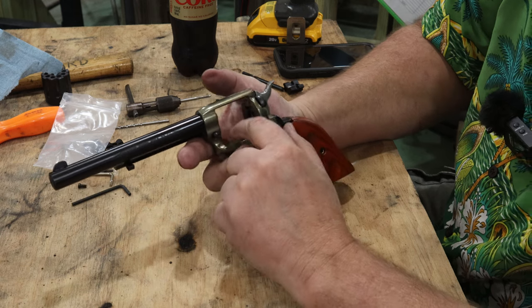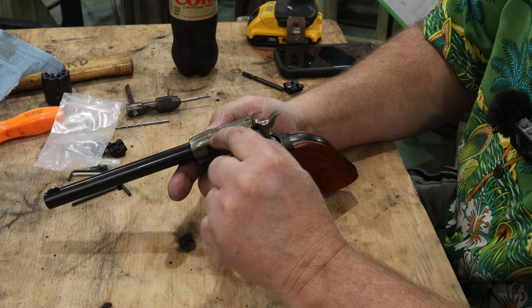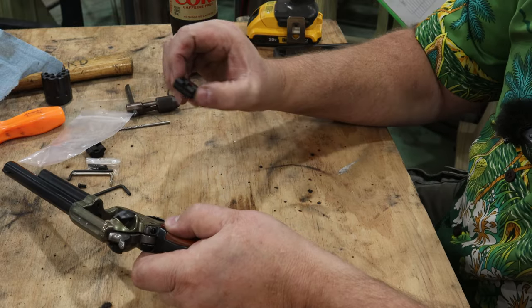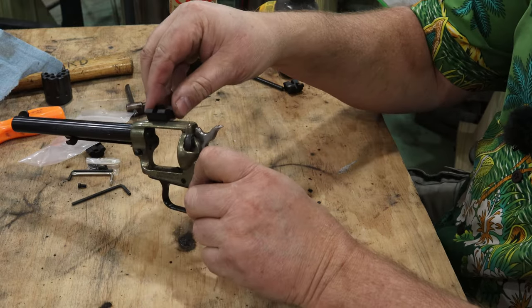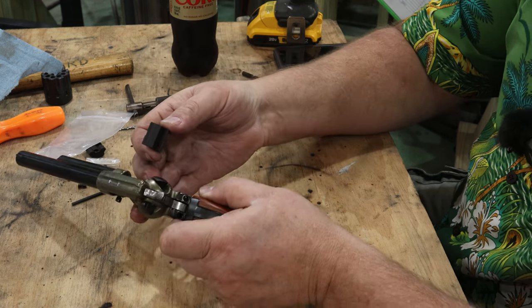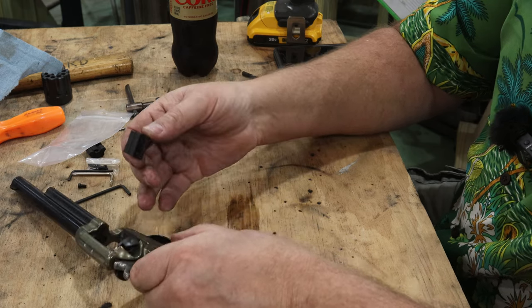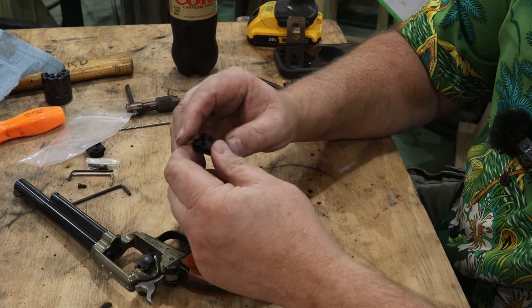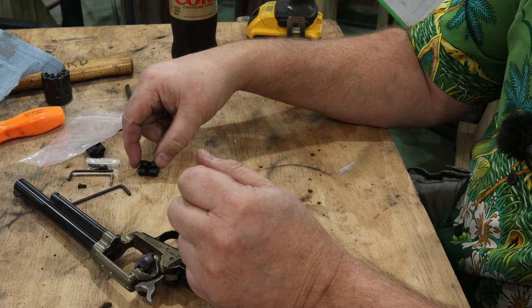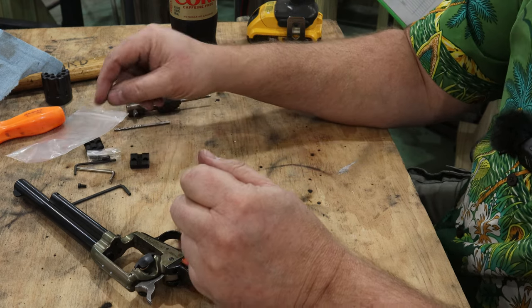So anyway, we're going to go ahead and put a little brake clean degreaser on here. And then I got to do my other little modification to this piece. And then we'll be bolting her right on top and hooking her up semi-permanently with some blue Loctite. My goodness, don't use red or don't use green. Use blue. Blue is serviceable. And we'll go from there.